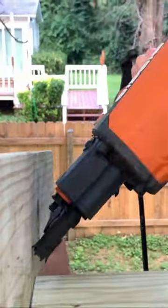We positioned all the rafters in place, then tacked them in with a nail gun, and then installed hurricane ties for an even more secure hold.